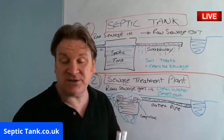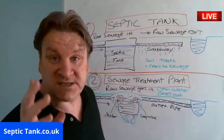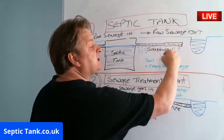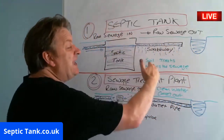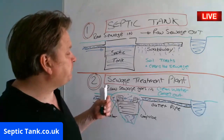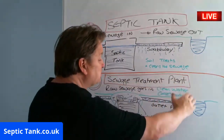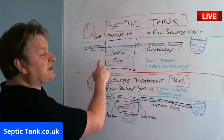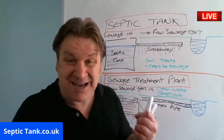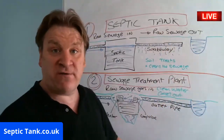Right? On the 1st of January 2020, all the rules and regulations in this country regarding septic tanks are changing. So if your septic tank, and many of them do, discharges into a watercourse or is close to a watercourse, this will become illegal on the 1st of January 2020. Okay, so many people will have to replace their septic tank in favor of a sewage treatment plant, because remember, raw sewage goes into a septic tank and raw sewage comes out. All right, and you have to wait for the soil to treat and clean that sewage. So it has to go through the land and through the fields, and eventually it makes its way into streams and rivers, but it's been treated and cleaned.